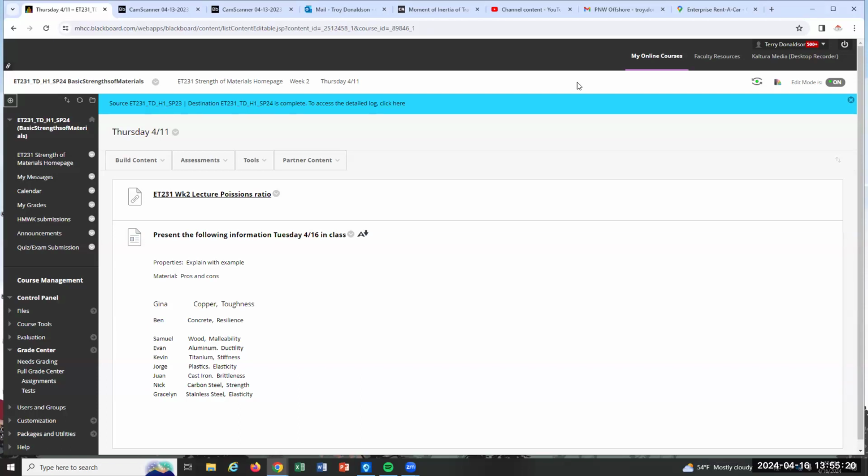Trade-offs everywhere for that. I have analysis of three of the medium carbon steels: 4140, 1060, and 1045, all in the 0.3% to 0.5% carbon range. I have the Brinell hardness scale because it was a really good number. Surface hardness, like if you hit it with a hammer, put a load on it.